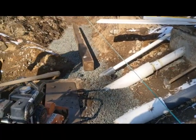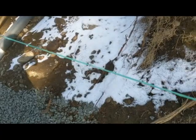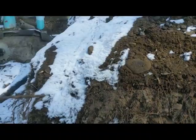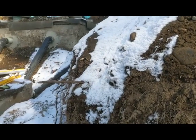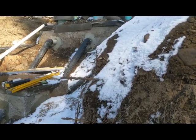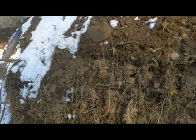Like you guys can see, that is the first one. We're gonna put a big hole behind it, that way it gets all the moisture from the soil, because there's gonna be some moisture in here. That way keep it safe. We're gonna fill behind the retaining wall with gravel, that way less moisture behind it.